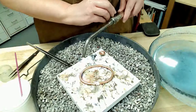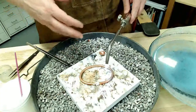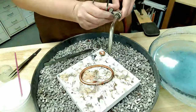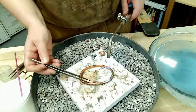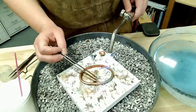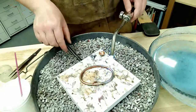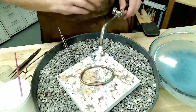Once the liquid has burned off, I can turn the torch up high. With soldering, quicker is usually better because the longer you take, the more your metal is going to oxidize. Remember that you need to heat the whole piece evenly — you're bringing the copper to the temperature that the solder melts at. You're not trying to just hold the flame on the solder and melt it, because it will not flow in your seam that way. You need to bring both sides up to the melting temperature of the solder, and then the solder will flow through your seam. For this job I'm using hard solder — I want the strongest seam I can get.